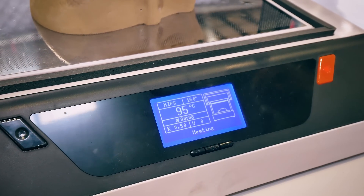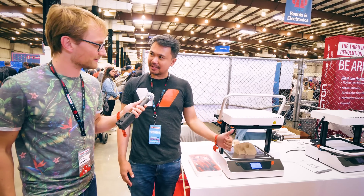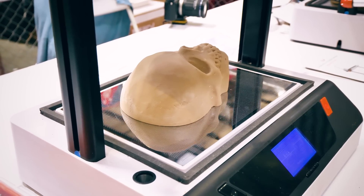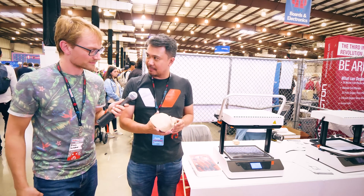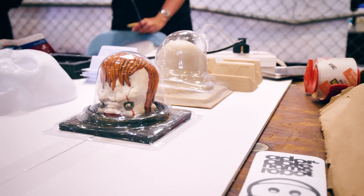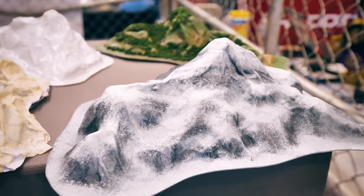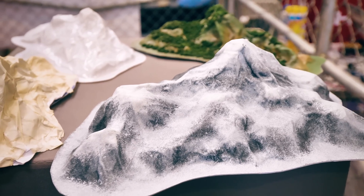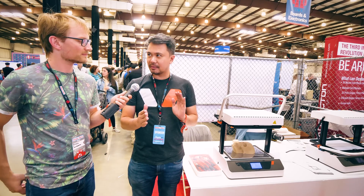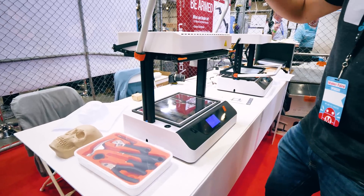That low for HIPS? That is pretty nice. We can actually go a little higher, but let's start with the default settings. So you've got a few molds with you. What is that mold material that you're using right now? This was originally sculpted in clay by a sculptor, but we resin cast it so that it's sturdy enough for the vacuum former. But typically you could 3D print something that's perfectly fine - print it in PLA, just as long as it's more shells, more support material inside so it doesn't collapse. Do you need any sort of release agent on your parts? No need - just take care of the draft angles, no release agents, smooth the sides maybe, but that's about it.